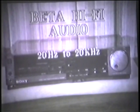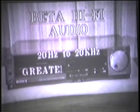The hi-fi stereo audio system, which Sony introduced 2 years ago, having a frequency range of 20 Hz to 20 kHz, has not changed. The high-fidelity audio with its dynamic range of greater than 80 dB is still recorded together with the video on the video track and simultaneously on the conventional monaural track, enabling non-beta hi-fi VCRs to play back the audio.